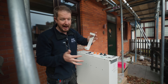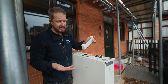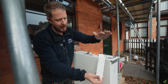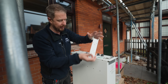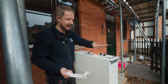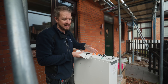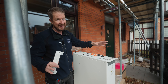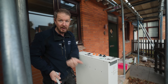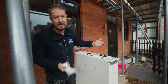Because we're mounting these outside we're using the cool box solution, but actually inside you don't even need a rack — these little brackets go on the sides and act as feet, and you can just stack them one on top of the other. Obviously you'll need to put them somewhere safe if installing inside. With PAS 63100 regulations, even though these are super safe batteries, those regulations say don't install batteries inside a living space — but a garage or outbuilding could be perfect.